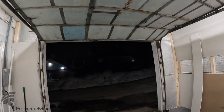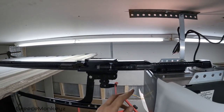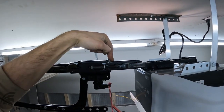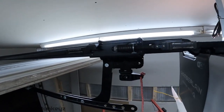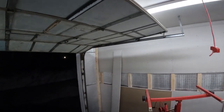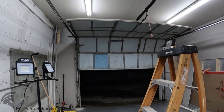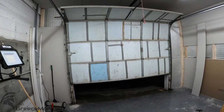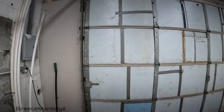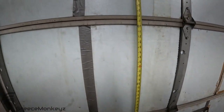The door is completely open — you can't really go any more than that without hitting the trim outside. Up here there's still a bit of space. The hole is somewhere around here, so we're going to drill a hole and put a bolt back here just in case, even though I already set it up and it stops there every time. We'll go ahead and put the safety features back on like they're supposed to be. We now have a seven foot garage door opener operating an eight foot door.